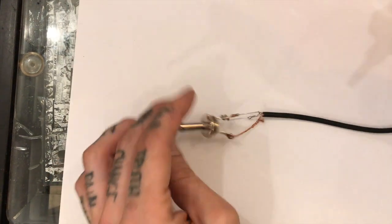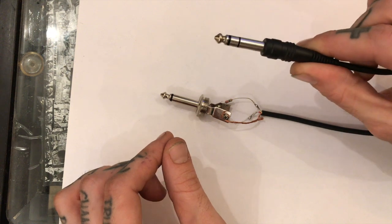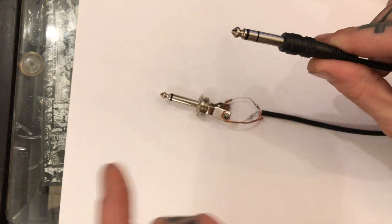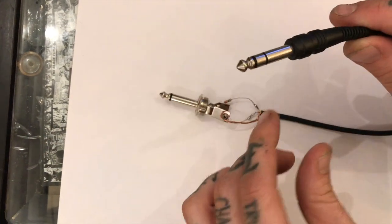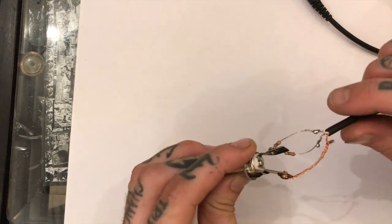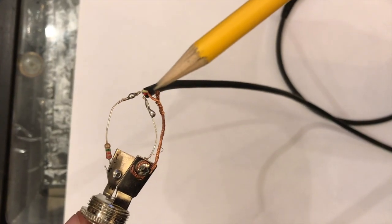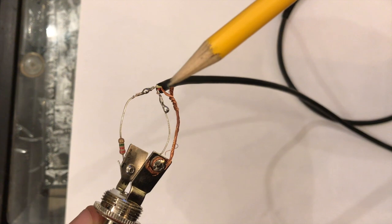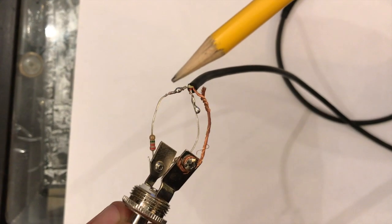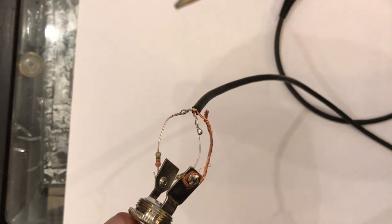What I did is I took an old single stereo quarter-inch connector cable — TRS, tip ring sleeve — and cut one end off of it. What you'll find when you cut the end off is three cables inside. One of them will be unsheathed — that's your ground. The other two are left and right for your stereo signal: red and white. So that's your tip, ring, sleeve — red, white, and ground.